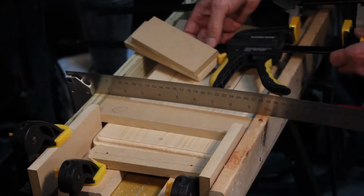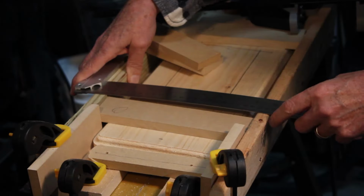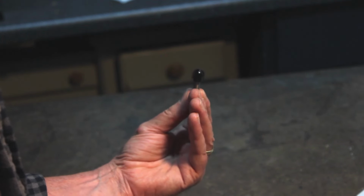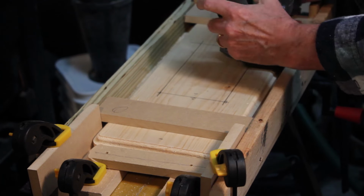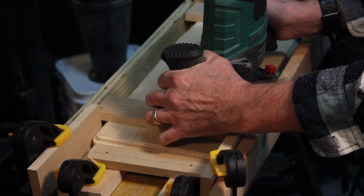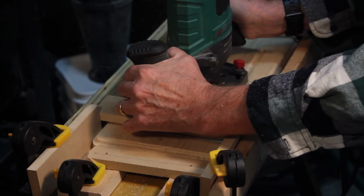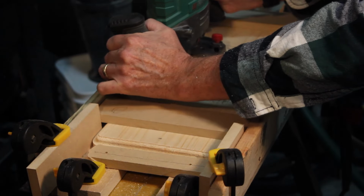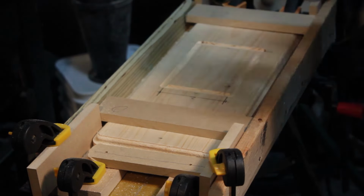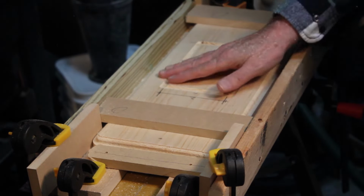I made a quick box jig so that I could also cut the square channel that's in the front using a half round or round bit and using basically some wood to block out the square shape that I need to accomplish this. I also did an experiment on the back side to make sure that this would work, and it did just fine.